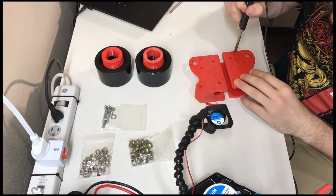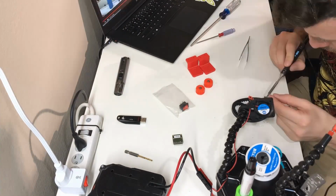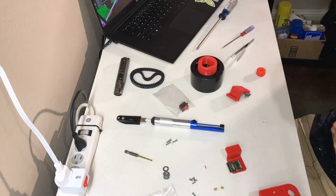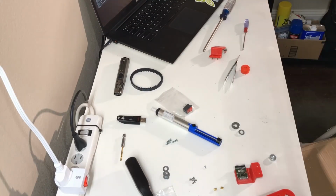Carefully check your build order here. You'll see me take these apart a few times. Also, the spacers for the wheels need to have the curve in facing away from the wheel. And don't forget to ream the hole that the axles go through before attempting assembly.